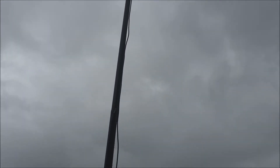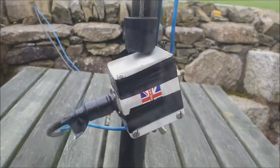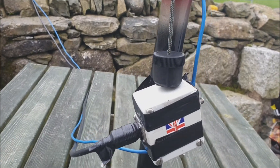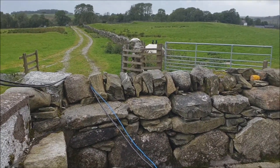We've secured the wires for coil, and down at the bottom here we have the 9-to-1 UNUN, and another 5-metre counterpoise — the blue wire running off that way, and the black one's obviously the coax.